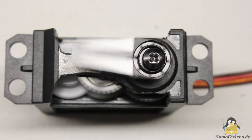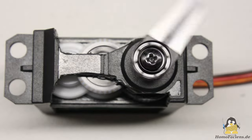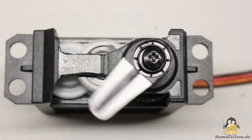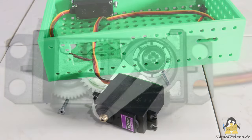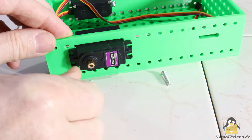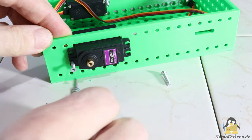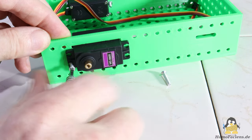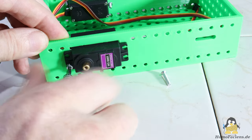For the drive motors, I chose standard RC hobby servos for continuous rotation. You can buy these as such or simply modify normal servos for continuous rotation — I have already shown how to do this. Hobby servos are easy to source at moderate prices. A basic principle of this robot is to use only standard components in order to make a copy or repair as easy as possible. Two of these are required and the servos are screwed directly to the chassis.